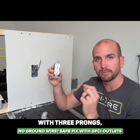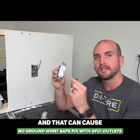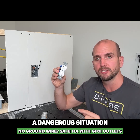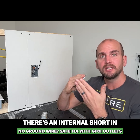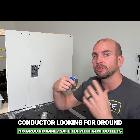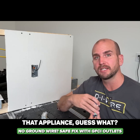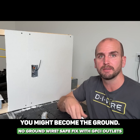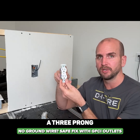You might plug in an appliance with three prongs — that ground prong is the equipment ground — and that can cause a dangerous situation where there is a metal case around that appliance. There's an internal short and that case is going to become your hot conductor looking for ground, which you do not have. So if you touch that appliance, you might become the ground, and that is a dangerous situation. Do not just connect up a three-prong.